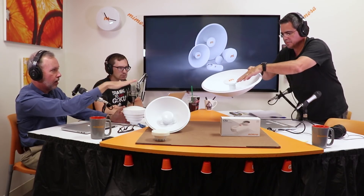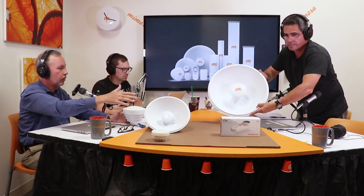With the parabolics, it's a slightly different solution. In the past — and many competitors have done this as well — the feed is often projected out beyond the surface of the front of the dish. The problem with that is if you can see the feed from the side, it's going to pick up interference. So in both the 400-millimeter and the 250-millimeter dishes, we've pulled back the feed so it's down inside the dish, improving your side lobe rejection. With horns you put choke rings inside; with parabolics you pull the feed back so the rays come down into it.